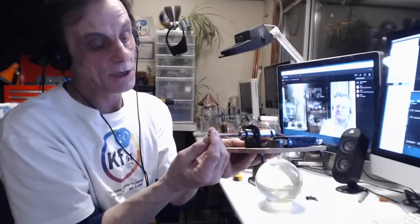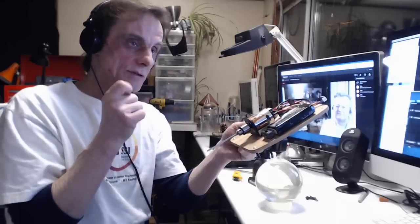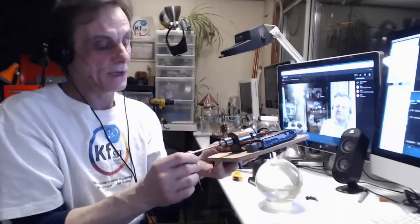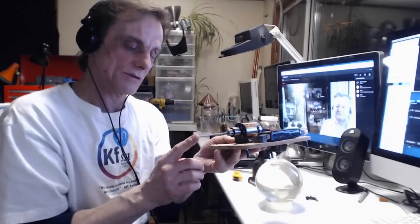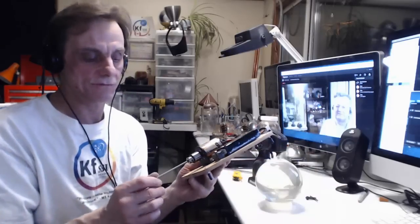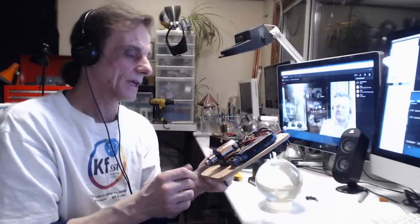Right now it's a tube. Maybe the tube will be a way to do it. Maybe a needle tip would be good. Maybe a needle tip with a little shot of argon gas coming through. It turns out that 5% argon is a perfect mixture to create that sonoluminescence. It makes the bubble work much easier. And that's relatively easy to do with an arrangement something like this. But I think just the right shape of tip might be enough in itself to create that bubble action. So in effect, you could create a light that's lit by a rotating shaft, and that would be pretty cool. That's very exciting. And the light's just the beginning, of course, because then you have a tiny wee plasma.